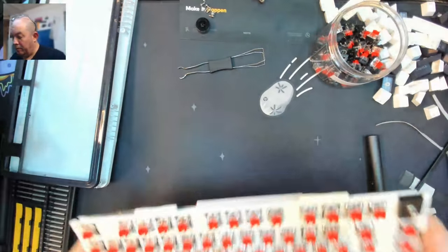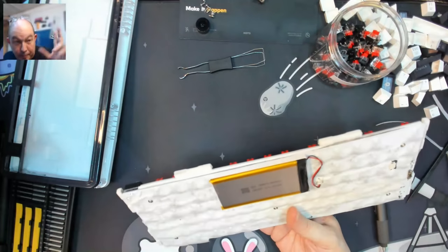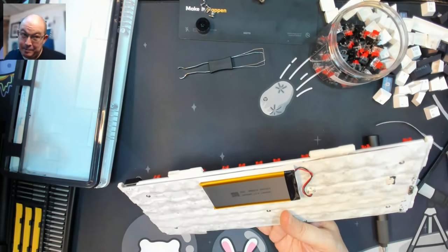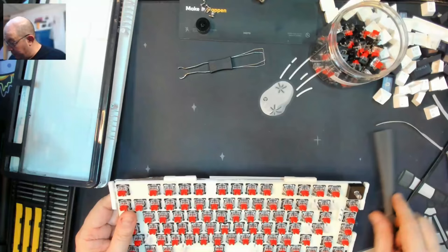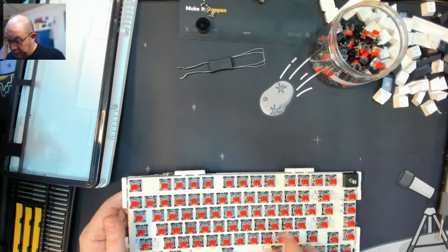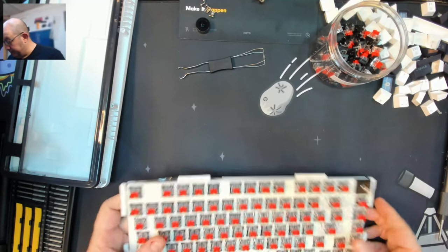All right, so now we have the plate PCB assembly with PE foam and the PET plastic mod. Obviously, we're doing the Ziploc plastic. It's a very similar plastic. It's not PET, but in my testing so far, and yes, I am working on a video, but I have to jump back and forth between them, but I will have a video that showcases several keyboards with before and after doing both the PET plastic, the 4mm, as well as doing the Ziploc plastic.